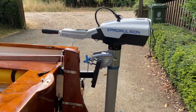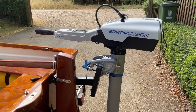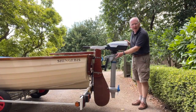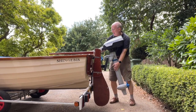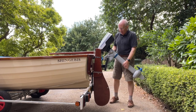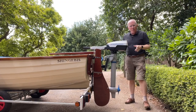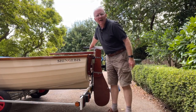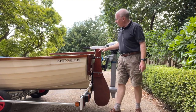That's the basic setup, but there are a couple of changes to make this more convenient. One problem I still have with this arrangement is that if we're getting into the shallows and I want to tilt the prop up, I actually can't — even though it folds up, I still can't tilt it far enough to latch in the upright position. The second issue is that if I'm sitting on the port side of the boat, it's quite hard to reach and steer with the outboard tiller all the way over there.